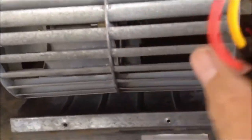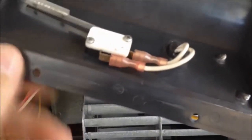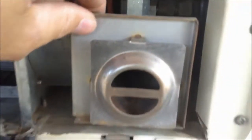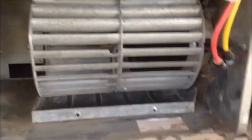I got the fan on this side and got my motor wired in. To protect the connectors I pushed them together and threw some electrical tape over them so they don't short out on anything. I just need to put this plastic door back on and we'll see if it'll fire up. I also cleaned the inside of this tray where the sail switch is so it moves nice and smooth.